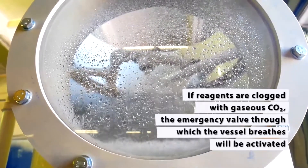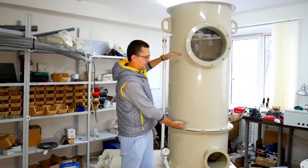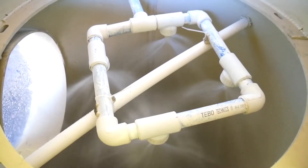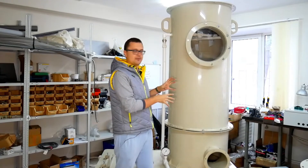The entire space with packings is sprayed simultaneously by all nozzles under pressure from above. The packings are sprayed with water, or water with an admixture — either alkali or something else — to clean the inlet gas. In this case, a certain acid with air enters the space, and this acid should be quenched.